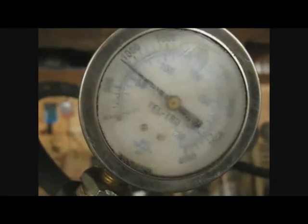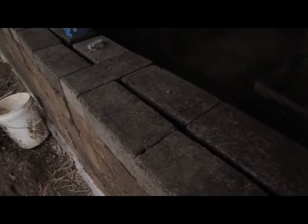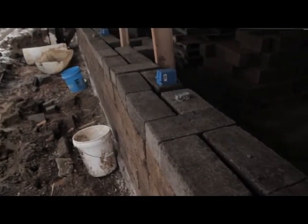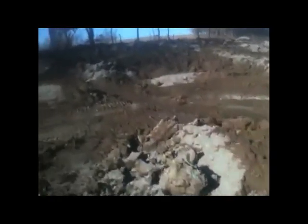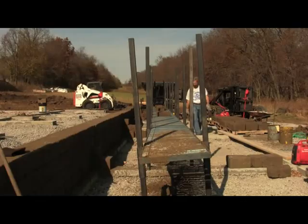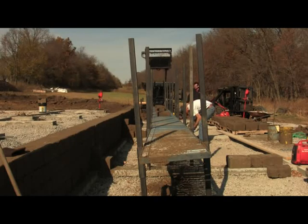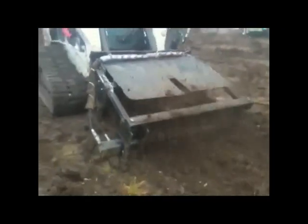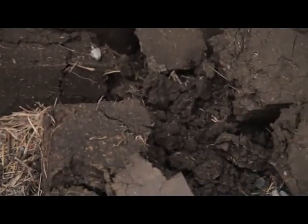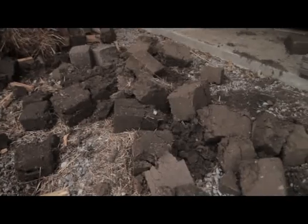On brick quality: compressive strength testing results from last year show 700 psi compressive strength for unstabilized bricks and 1,100 psi for stabilized ones. Translated, that means that a 1 by 1 foot brick area or wall can support up to 100,000 pounds of weight. The soil late in the season was not easy to work with — it took days to dry and was too clay-heavy in our particular building location. We added crushed limestone to amend it. Starting in full production in mid-October, we could press bricks only about half the time until December when we finished, because the soil simply never dried up enough to press good bricks. Good bricks come about when you can see dust in the soil you're working with. Otherwise, they are too pliable after pressing and can be bent and deformed easily due to water content. We had one batch of bricks that had so much water in it that after a frost, a bunch of bricks simply disintegrated because of internal freezing.